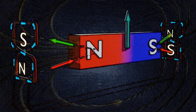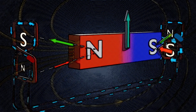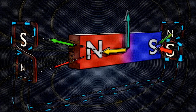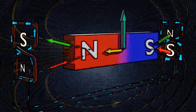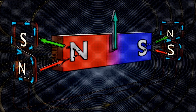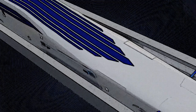If the train moves slightly to the right, this shift will disrupt the balance of the electromagnetic fields between the left and right coils, causing current to flow through the interconnecting coils. This current affects the magnetic force in the lower loops, altering the strength of the poles in each loop. When analyzed, the vertical force remains the same, but a horizontal force pushes the train back to the center. As it moves closer to the center, the current decreases, and the horizontal force disappears, restoring stability. An incredible mechanism to maintain orientation stability.